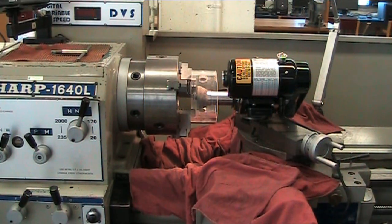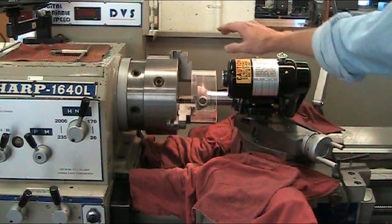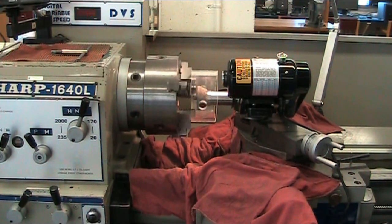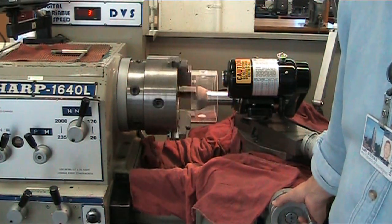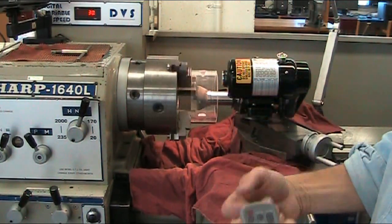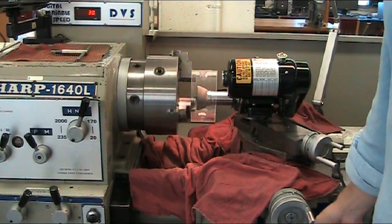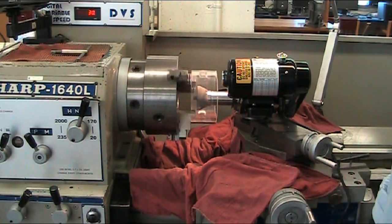The first thing you do is turn on the lathe and get it going at an average slow speed. Thirty RPM is a pretty good number. When you turn on the Dumore grinder, you crank in about 2,500 — but in this case we're actually cranking out because we're going to be inside the actual jaw. Then you turn on the power key. We've got the power feed set at about 0.020 per revolution.